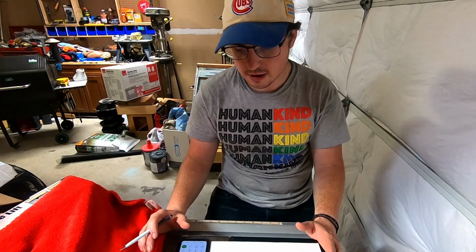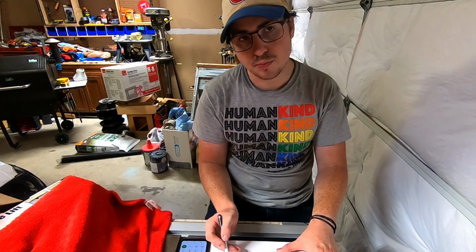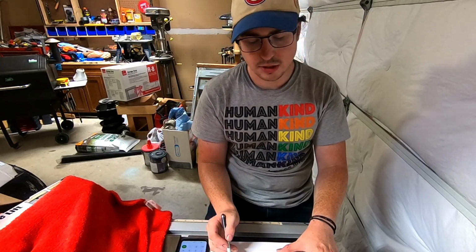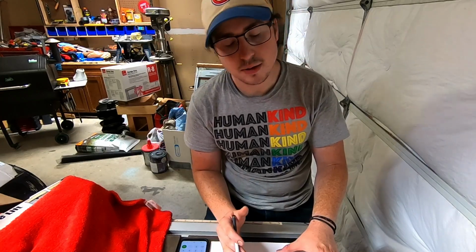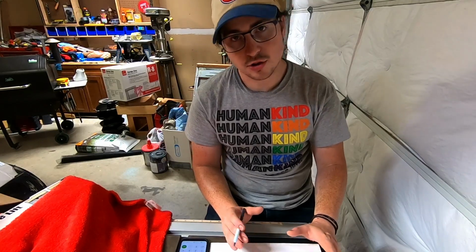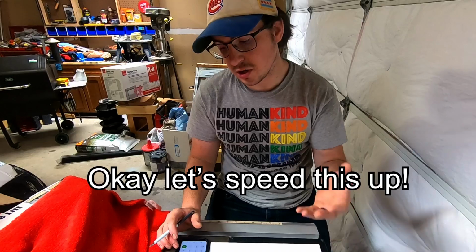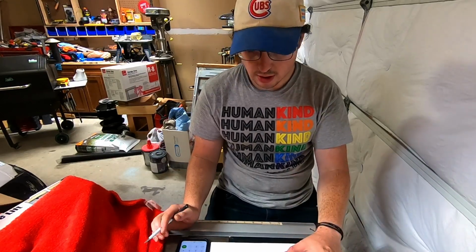So now what I'm trying to figure out in my head is how much space I want to put between each one of our ceiling joists in order to not have too much weight, but also be able to support the corrugated roof. So now I'm just gonna try and figure that math out. We've got 5 feet, we'll divide that by 4, it gives us 1.25 feet between each one, so that gives us 1 foot and 3 inches between each board, if we went 4 across it.